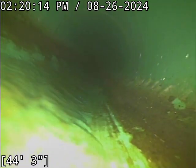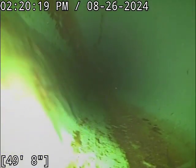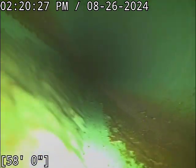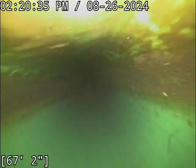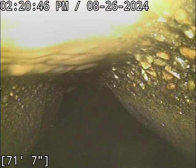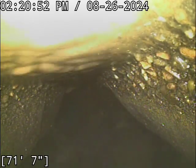Anyway, we just transitioned over to 4-inch 3034. A little bit of standing water there at the transition. Thus far, does not look concerning. It looks very minor. We'll get a nicer view of that on the way out when the line's drained. And a fairly clean sewer line, the flow line. There's a little bit of grease in here, but nothing crazy. Camera's upside down at the moment. That little dangly item there at the top of the pipe just looks like a big old giant cobweb, not a root. And that right there is the main connection. We're tying right into the manhole out in the street. We're going to go locate that real quick while the pipe drains off, and we'll get a better look at everything as we come back in.